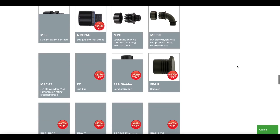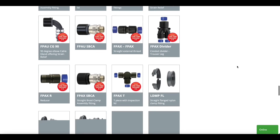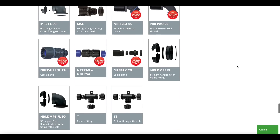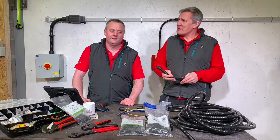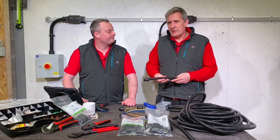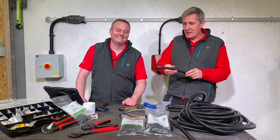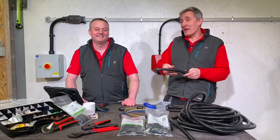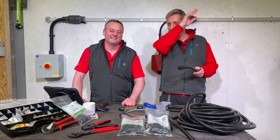Thinking about temperature rating: it's plastic, but even so this conduit goes from minus 40 all the way up to plus 120 degrees Celsius. Temperature is important especially when you get to that IP69 rating - we're talking about hosing it down with hot water, possibly for food industry applications. We've also made a short video showing how you can thread wire through long lengths of flexible conduit using a vacuum cleaner, so check the link above or in the description.